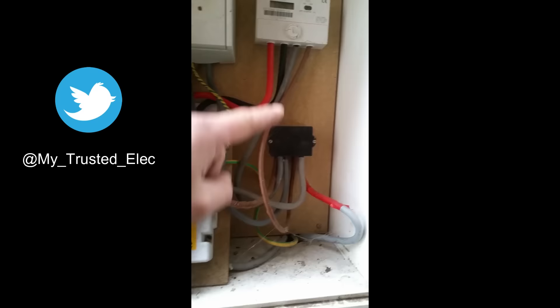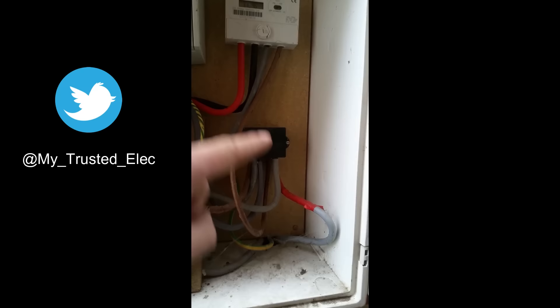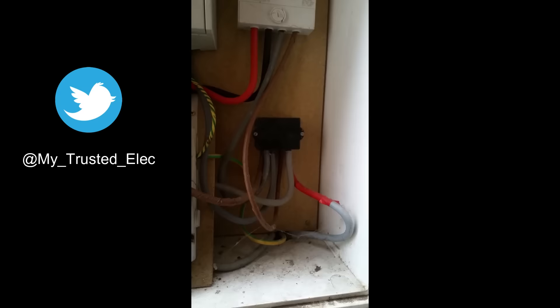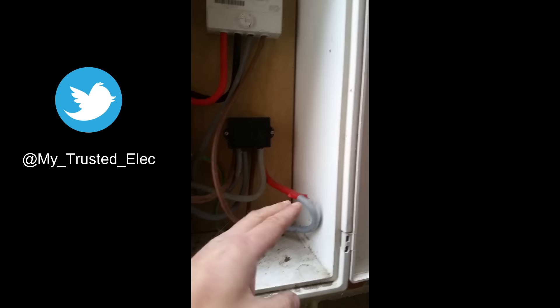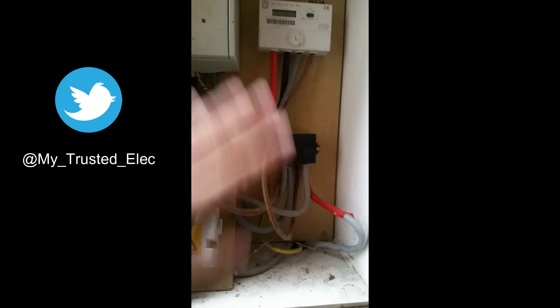I'm going to guess it's an earth cable they've taped up that goes into this service head. Tags have been cut off. They've obviously removed the tails and put their own cables in. They must have used an earth cable for the phase. And they've probably had a bit of black - it is black. Which is weird because I can only imagine this has been done recently, but they had some black meter tails from somewhere. They've obviously installed that Henley block - God knows what.